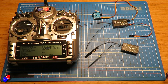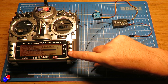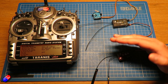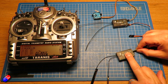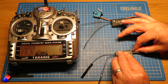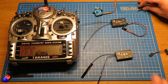Let me get ready to power it with five volts and get something to press the bind button. We're going to hit enter and bind channels one to eight with telemetry off. While it's beeping, we hold the failsafe button and power it. The red LED is flashing - that means it's good. We exit out, unplug it and plug it back in and we should see green. I'd definitely recommend setting your failsafe too, but it is bound - we can confirm because if we plug the servo into channel one, there's the servo moving. So we know we're all bound and good, but that's only the first part of the challenge.